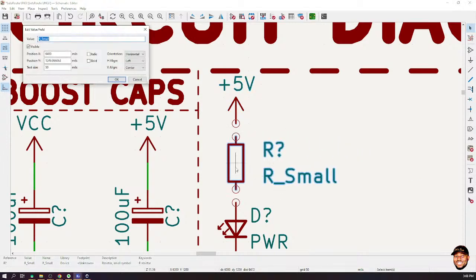Okay. So let's put a 300R. Now, usually resistors are actually measured in ohms, okay? But mostly in electronics, you see their prefixes. For instance, if I have 3,000 ohms, I would rather prefer to write 3K. If I have 10,000 ohms, I would prefer to write 10K in that order. So you see K for kilo, M for mega, G for giga.